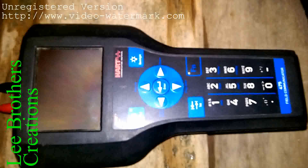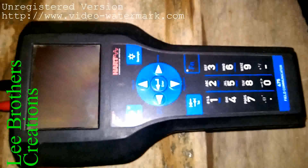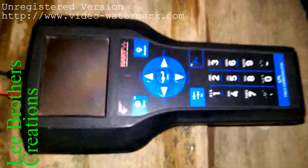Come back through the menus. The loop test is now finished. Go back to the home page. Switch off the communicator — select the power button, click enter, and shut down. Now disconnect the communicator and put the back cover on.